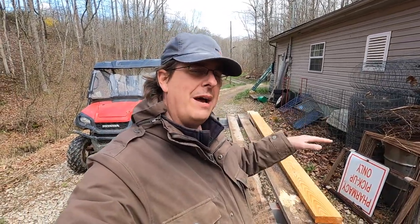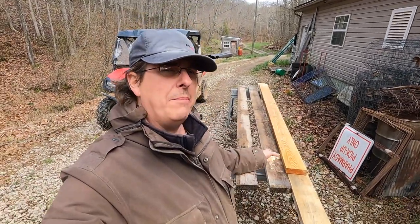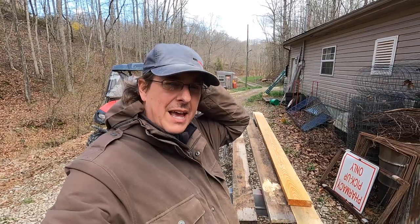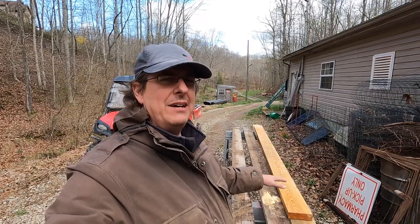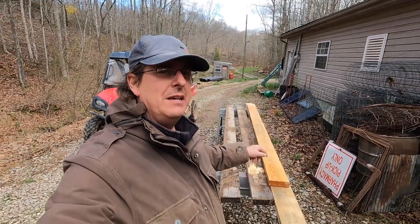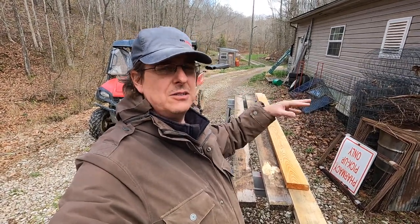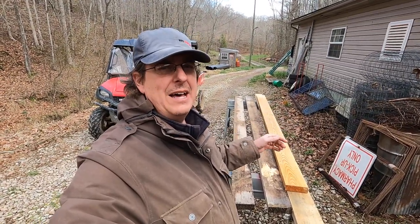I need four boards — four eight-foot long boards that are going to be ground contact and run the length of my two cattle panels: 16 feet each, 32 feet total, four eight-footers. My West Virginia math working — I think that's right. What I pulled from my pile are two pine and two poplar. I'll say I'm being extra scientific because I want to test the two, or I could say that's kind of what I had on top of my scrap pile. With this pine and poplar, if I just stick them in the ground, the bugs are going to jump all over them, the fungus and decay are going to start eating them down the way God intended. So we want to try to slow that down a little bit.